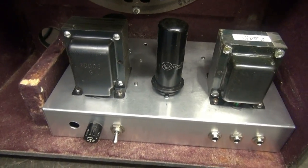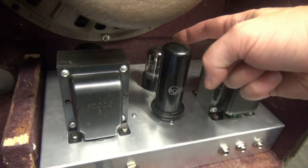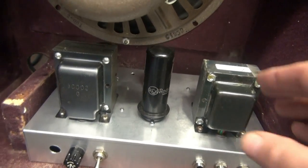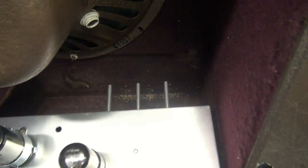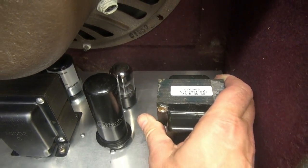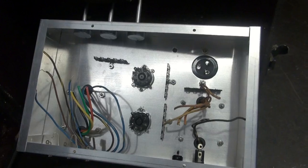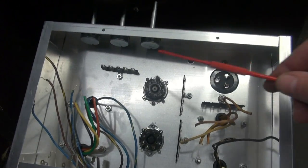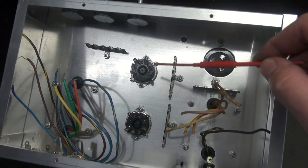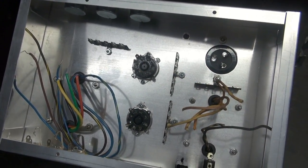Here's a follow-up on the amp build. You can see I've got everything mounted up — there's the 6L6, the old 6SL7 back there, outputs for speakers, transformers installed, plenty of clearance. And the cool thing is, if I pull this out, you can see the control shafts — I drilled those so they slide right through the front of this thing. So the controls will be front-mounted, and your power is going to be on the rear. Quick tour of the bottom side: you can see our pots installed, the filter cap, power transformer with his little terminal board, tube sockets, and here's the output transformer wiring. Now it's time to get this guy wired up.